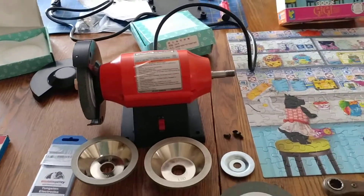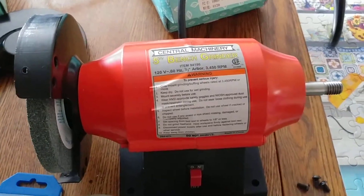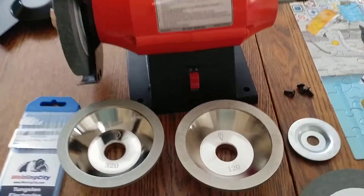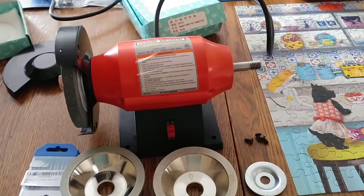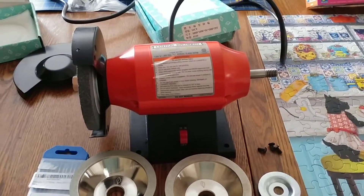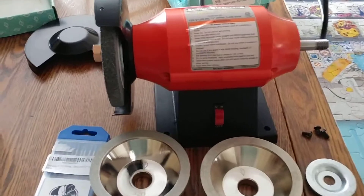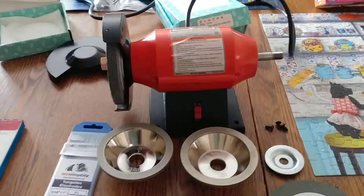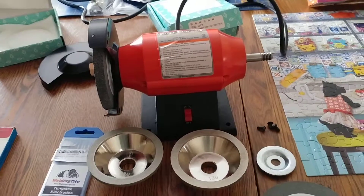I picked up a couple of these from Harbor Freight. I said Harbor Freight — I don't normally shop there, but I just wanted a cheap grinder to convert and use these diamond wheels on. I'm going to try and slow it down with a dimmer switch. I've seen a couple of videos where young fellows had done that and had success. I believe it was with AC induction motors, which is what this is — there are no brushes in this. So we'll see if that works out. I'm going to do a test on a different motor first before I smoke a brand new one and make sure that the dimmer switch works.